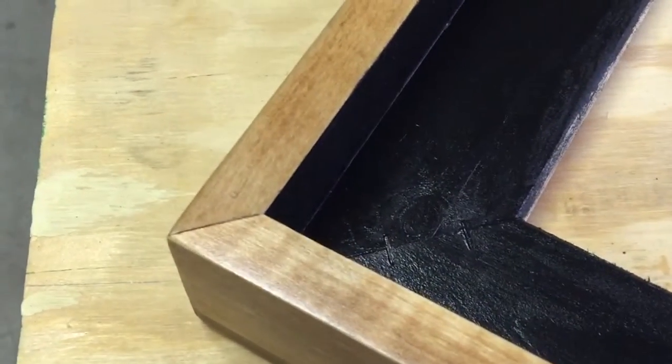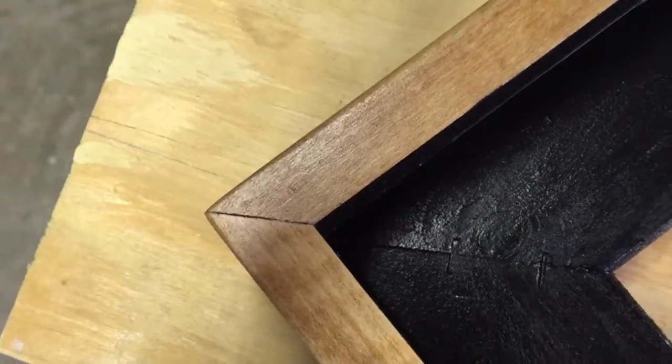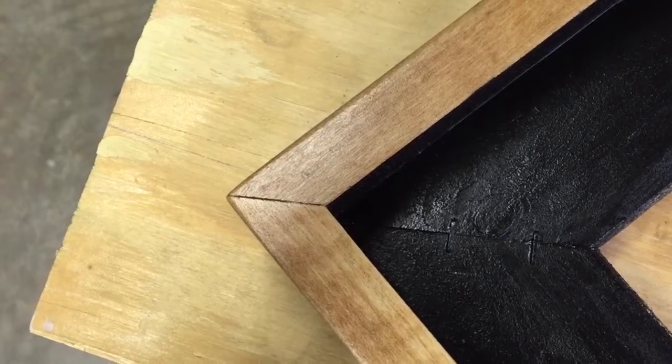Here's the corner of the frame where I've measured and that fits together nicely. I don't have a big gap where those two pieces of wood should come together. I'm sure you've heard the woodworking slogan: measure twice, cut once. My advice to you is to make sure when you're cutting miter joints, don't just trust the markings on your miter saw. Get your carpenter's square and measure, and make sure you get those cuts at exactly a 45 degree angle.